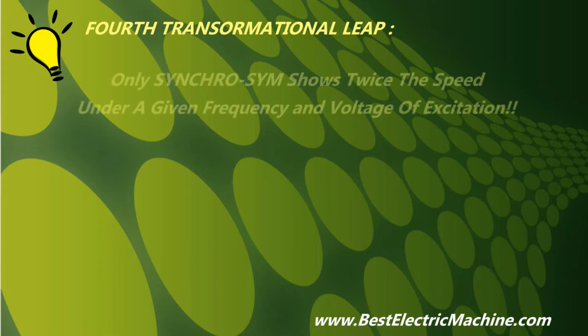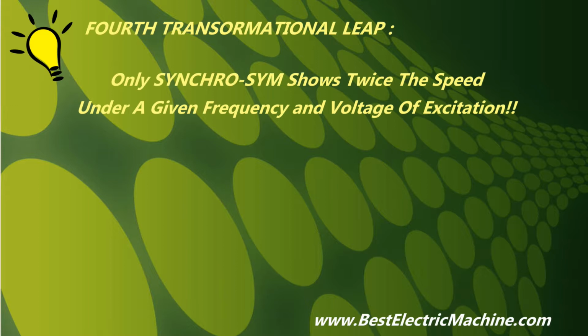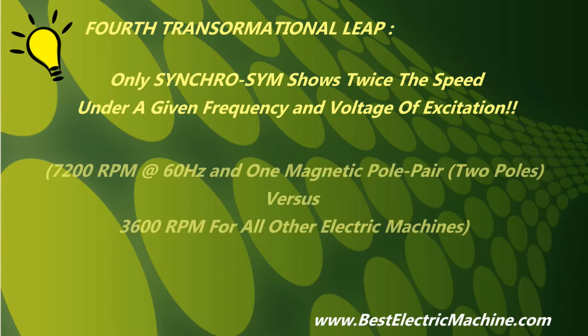Fourth transformational leap, with contiguous and stable operation from subsynchronous to supersynchronous speeds, including about synchronous speeds, the new electric motor system shows twice the speed of any other electric machine for a given pole pair count, voltage, and excitation frequency of the active winding set, i.e., 7,200 rpm with 60 Hz and one pole pair, versus 3,600 rpm for the conventional electric machine system, which is a recognized characteristic associated with half the cost, half the electrical loss, twice the power density, and twice the specific density.